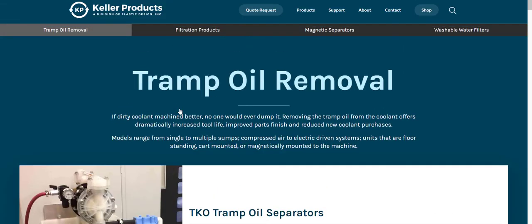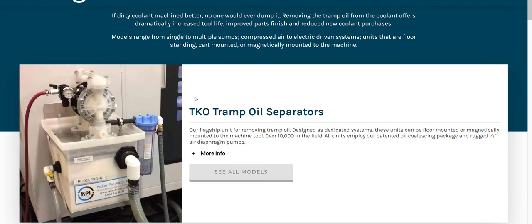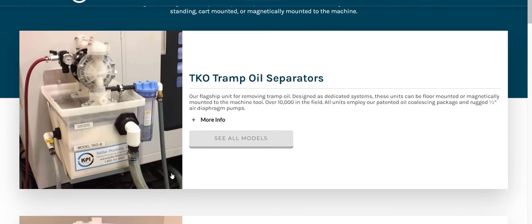Finally there's the Keller, which I came across on a forum — it's less commonly mentioned. Same principle: a diaphragm pump in the tank pumps coolant up through a filter and down into a tank containing a stack of plastic washers. Blasting the coolant through those washers separates the oil — the washers are cheap to replace every couple of years. The clean coolant outlet pipe sits at the bottom of the separator tank, goes up and back down into the coolant tank.